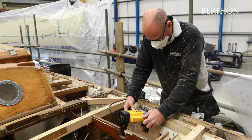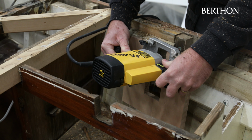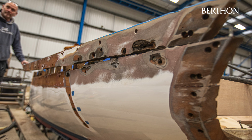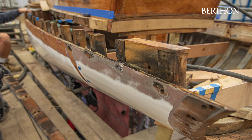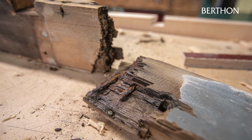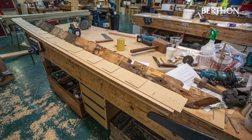Many localised dry rot pockets can be repaired in place by simply removing the decayed timber and scarfing in repair sections, although the structural aspects need to be considered, and with a large number of repairs in a small area, replacement of the timbers needs to be an option.